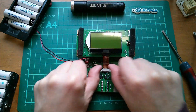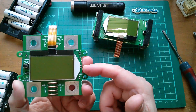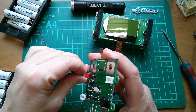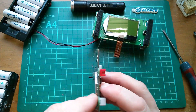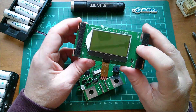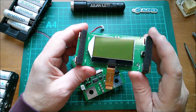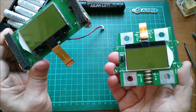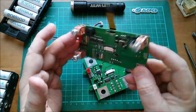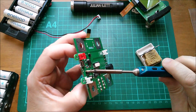Let's slide that and get the LCD out. I need to take the old LCD module off the old board — the only thing holding it on is the two connections for the green backlight LED. I'll have to unsolder those and take the power connector out. Incidentally, I should do a screen grab on the AliExpress item — I think it was either £11 or £13 with free shipping. I'm quite happy to pay that for a replacement LCD, as this monitor is really important to my shed system.